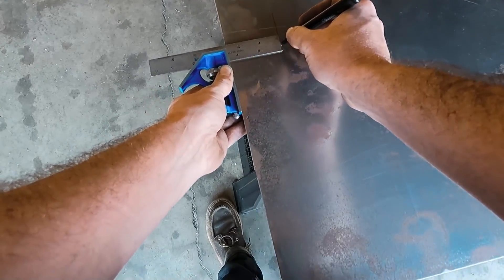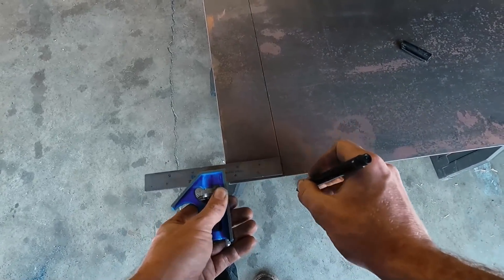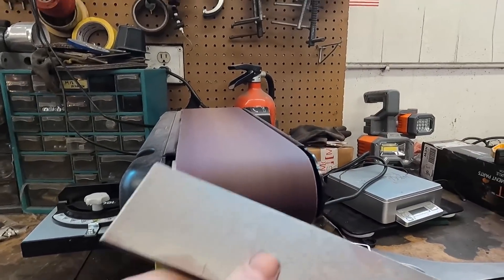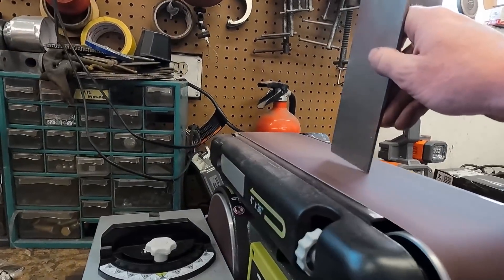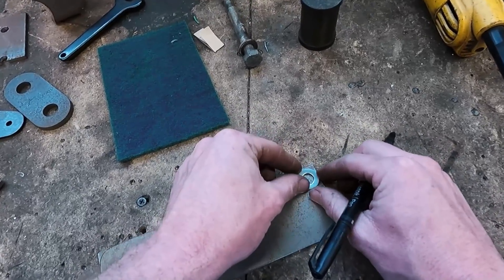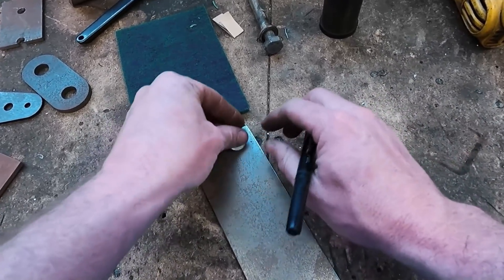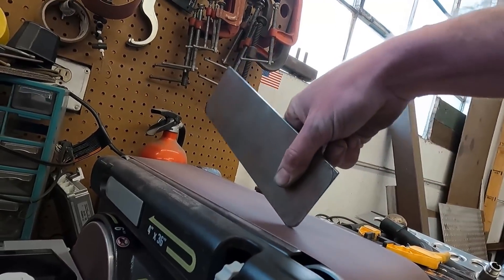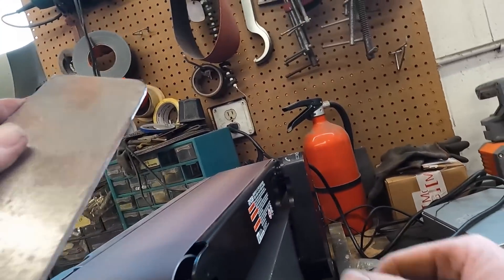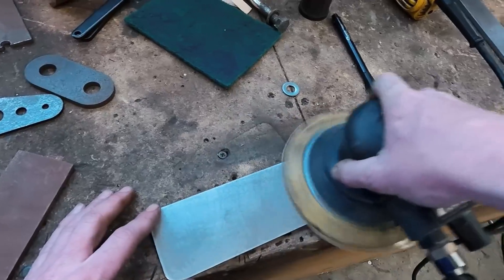The other side of the bushing needs a bracket to hold it and a base plate to mount that bracket to the chassis. We're starting with a base plate using eighth-inch plate steel, grinding out a shape, marking some radiused corners, and building it out for a nice finished-looking product. I snagged this belt sander since the last episode — I just went to Home Depot and bought this Ryobi one for about $150, and honestly it's done the trick a lot better than I expected.